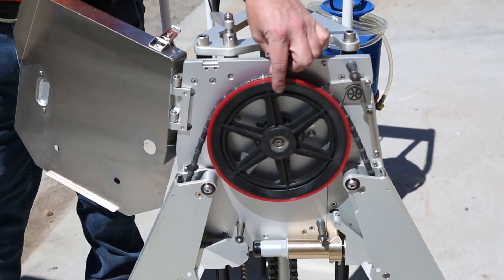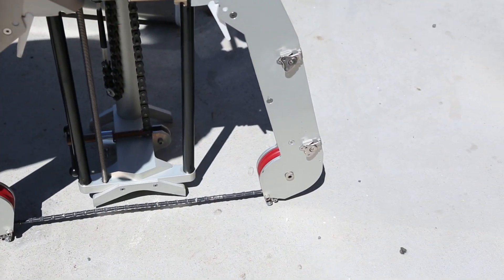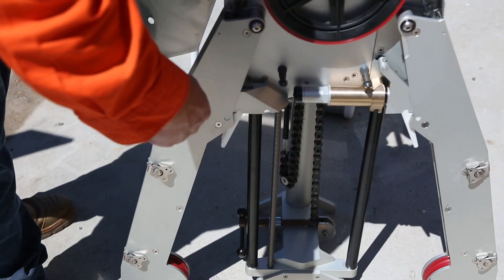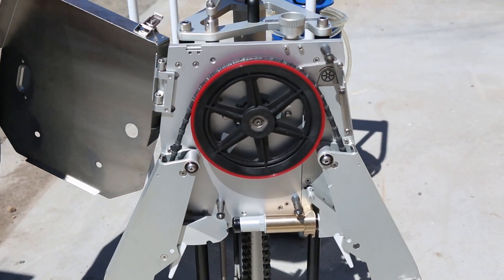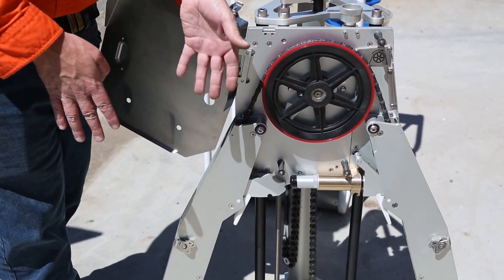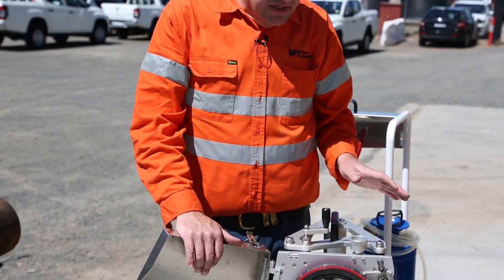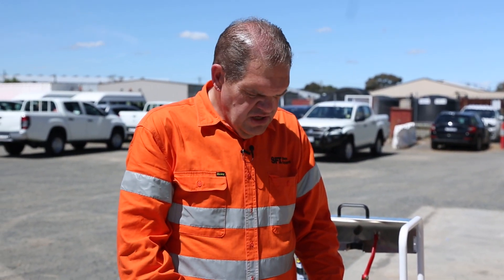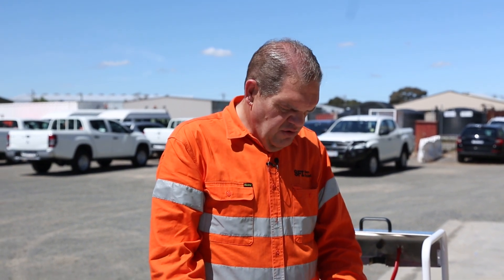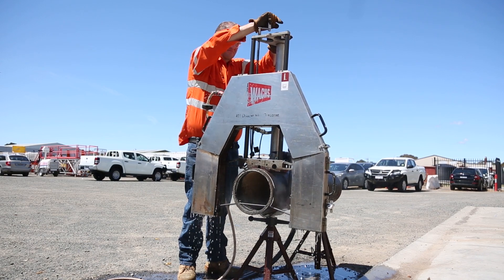To get into the saw, we open that at the top here and then open it out. We can see our drive pulley, and down the bottom there we have two idle pulleys — the saw rotates around like this. As the operator winds the saw down, the front of the saw comes down as it cuts the pipe. It's really simple and safe. The saw is attached to the pipe, so once secured, it can't jump off or move around. All the operator has to do is stand here and wind this down — it's a very safe method of pipe cutting.